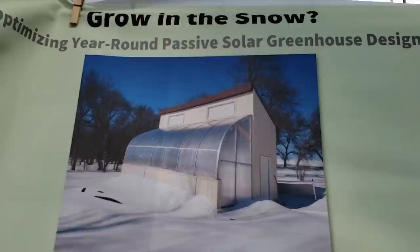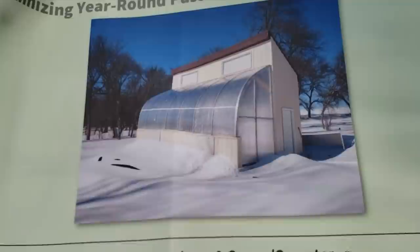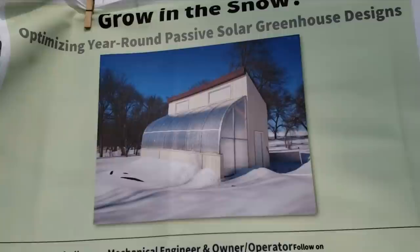Yeah. I know you mentioned in your webinar the difference between your passive solar greenhouse and a deep winter greenhouse, for example. And I noticed on the deep winter greenhouses that they have an insulated wall on this side, and the other side is an insulated wall. So what was your reasoning for not doing a fully insulated wall there? The sidewalls, the east and west sides. Light. Okay. So you get more morning and late evening light into your structure.